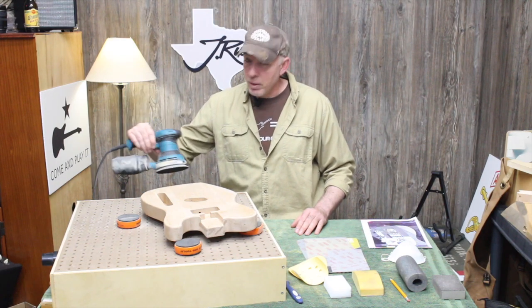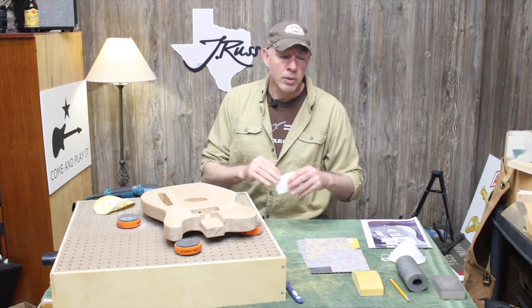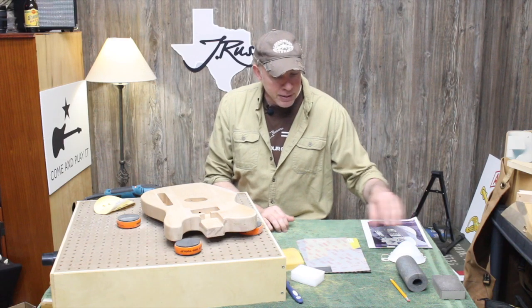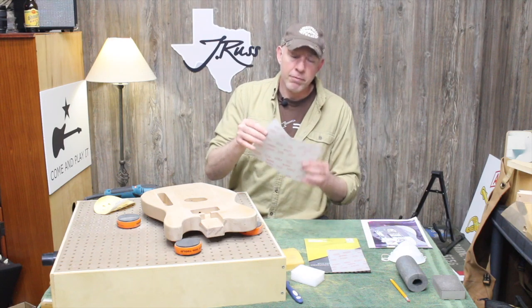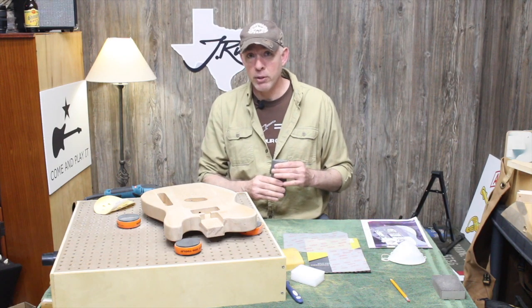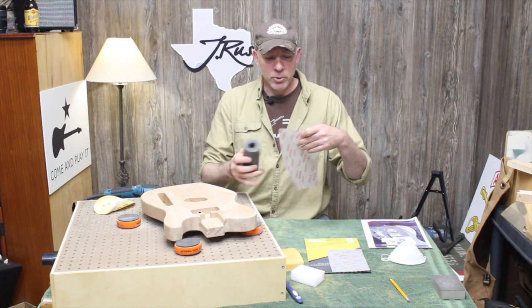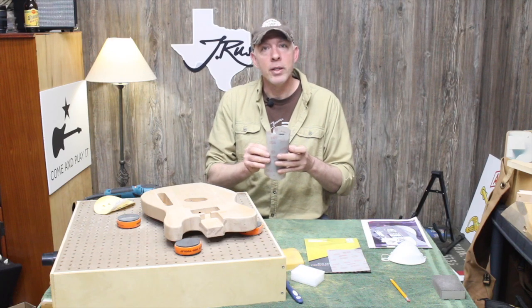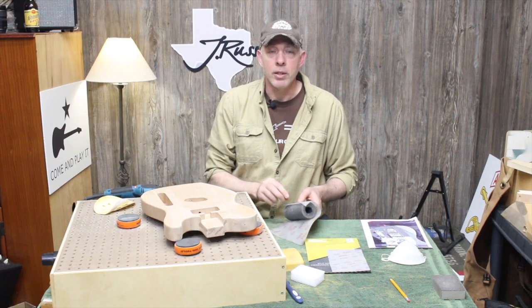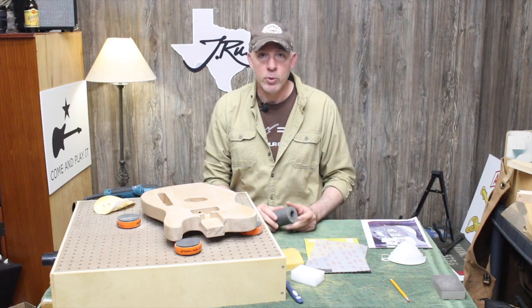For the big flat parts on the front and back, I've got my random orbital sander with some 220 and 320 paper. I also have various foam blocks for any flat pieces I need to do by hand. Importantly, I've got 3M 220 and 320 flexible sandpaper, which is great for the curves. And from my last video series on the PartsCast Relic Stratocaster build, you'll see how I used foam pipe insulation material — I wrap the flexible sandpaper around it, which is great for getting inside the horns, maintaining positive pressure around corners without inducing flat spots.